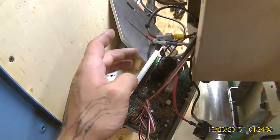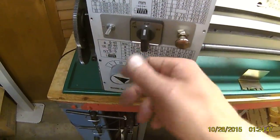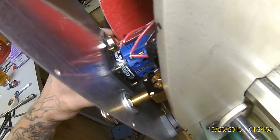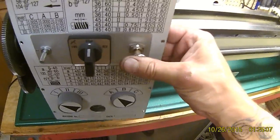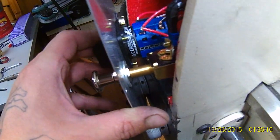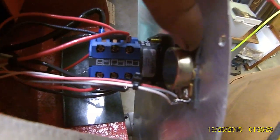As I discussed in the first video, the only thing different you hook up in here is how you hook your motor up, because you're going to be running your motor through the reverse switch. I actually added a piece of aluminum on the front of this because the original Grizzly factory aluminum had big holes from the on buttons and I needed something smaller. I also cut some thin rubber and put it on the potentiometer so I'm not grounding it out.